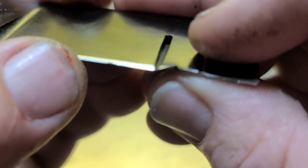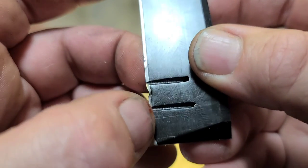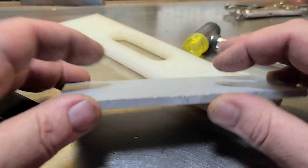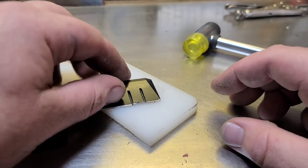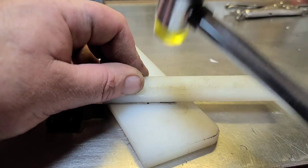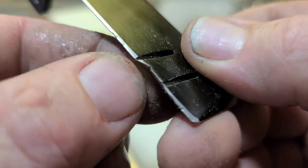Now we can really see the damage. It didn't actually break the aluminum — it just bent it — and it probably wouldn't have happened if I hadn't sharpened up my leading edge. I'm going to try to tap it back into shape with this rubber mallet. I'm using this old cutting board as a block to beat on — it's really tough material. Also got a flat punch here to help roll that bent edge back over. Trying to roll that bent edge — about got it.